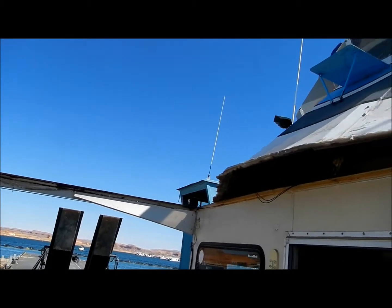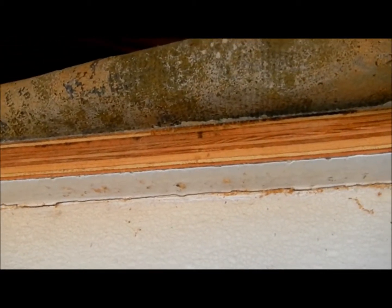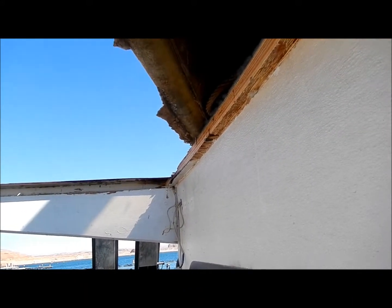And in the back here, the gap that we've left is 1.25 inches wide. We would expect you to put a 2x4 or maybe 2x6 against this wall, and then put an additional 2x6 on it to support the rest of the roof. Does that make sense? We've got the dimensions of this, by the way, too.